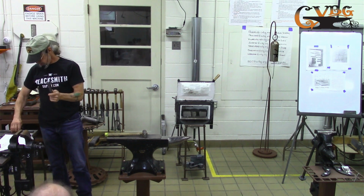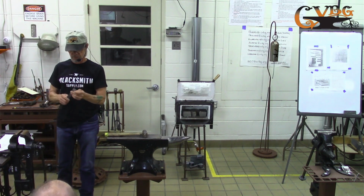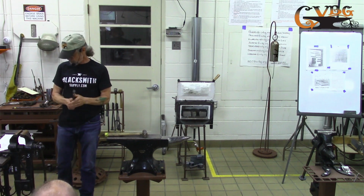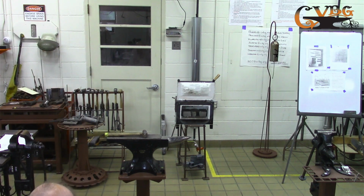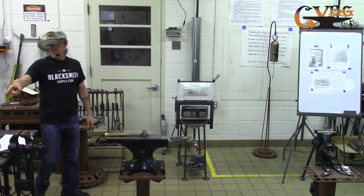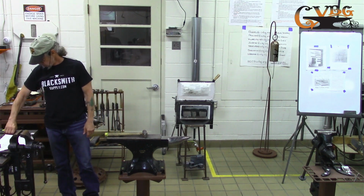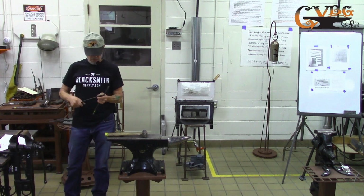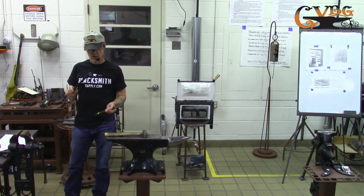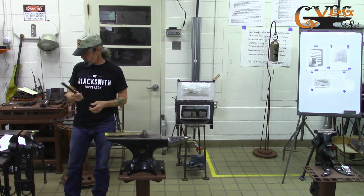So I started with that, and then I welded the two pieces together and punched through. So that was how I got started with it. And I'll put both of those pieces in the iron today. So I ended up making two pieces for myself. One I made with the punch too big, so that one works for 3/8 inch stock. And this is the one that I've used most of the time for 1/4 inch stock.